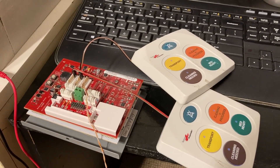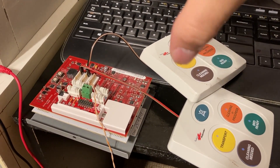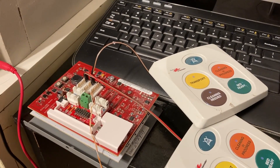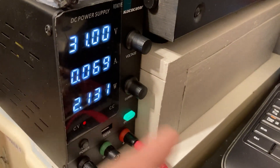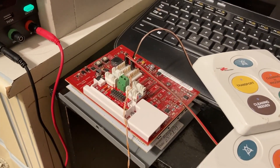You have a network drop that comes down into the light. It gets its activity and probably power as well from the PoE switch - Rowland does make a PoE switch for this kind of stuff. It gets its 31 volts, or technically it's supposed to be 35.6 volts, but it runs fine on 31.